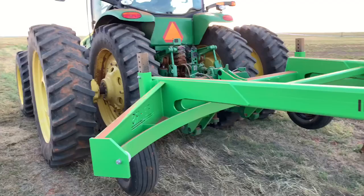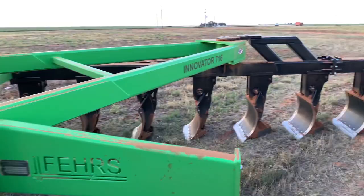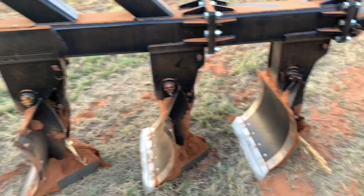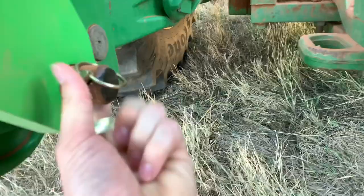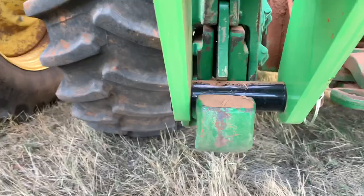It's about 8:37. I'm going to call it a night for today and then head back early tomorrow morning. All right, it's the next morning and time to get back to work. Got my diesel tank here — I'm going to fill up the tractor with diesel, going to service the plow and grease everything. Every single one of these units here has a grease insert. I also bought new pins, which I'm going to put in right over here because these are not the right ones and I do not want them falling out. Much better — now I don't have to worry about these pins falling out.